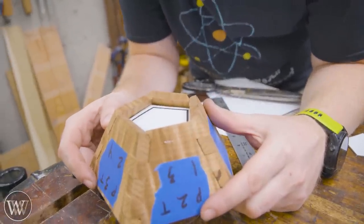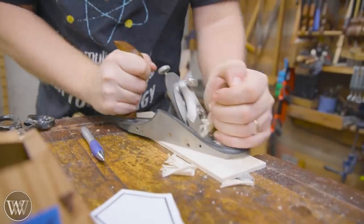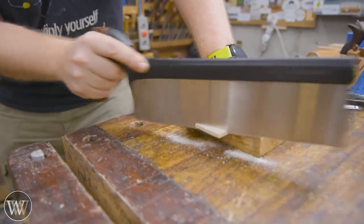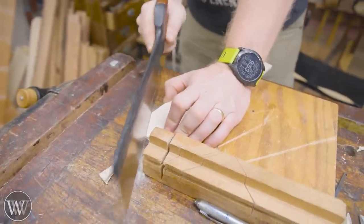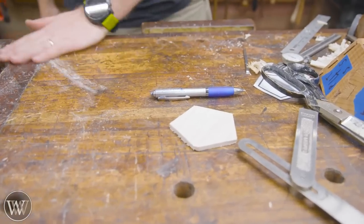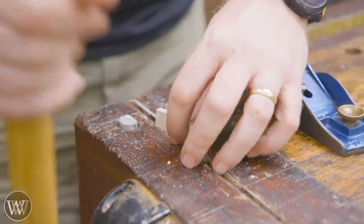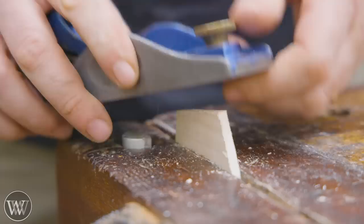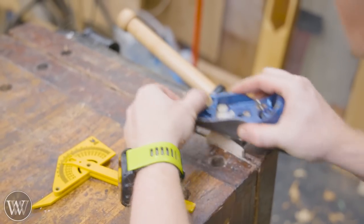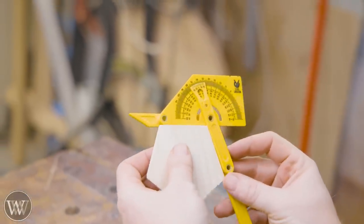I need to make it a little bit bigger because it actually needs to go into the groove, not just sit on the edge of the groove. For my first attempt, I'm going to be using regular maple — this is actually a curly maple, the exact same wood these sides are made out of, so you can see what happens with torrefaction: it goes from this bright white into that golden color. I took this one down to match the pattern, when I should have actually made it about an eighth inch bigger on all sides. I bring in my gauge and check each corner, pick one as the correct side, take one to be the right angle from that, go to the opposite one, and check the other two — now I know I have a perfect pentagon.